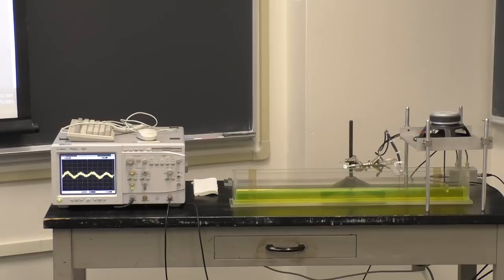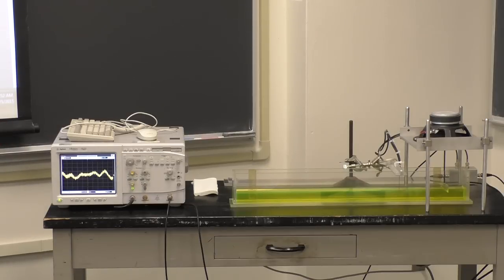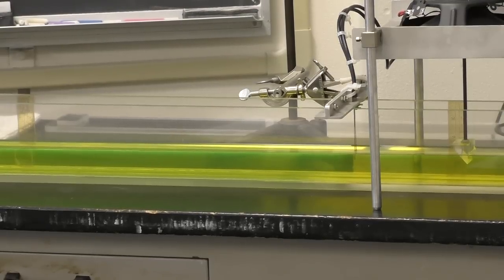Can you guys see that wave height? The wave's there - that's the same frequency, you can see the period is about the same. But what's happened? We're starting to see noise. It's ultimately every transducer - it's quantified by the signal-to-noise ratio. And watch when I touch the oscilloscope - there's some electrical thing with me touching. I'm moving the table - we're zoomed so far in now that just a little tap of the table does that. It's impressive. And there are ways of cleaning this up - one way is to go back and look at that circuit diagram and add a preamplifier with some filtering in there. Anybody have any quick questions?